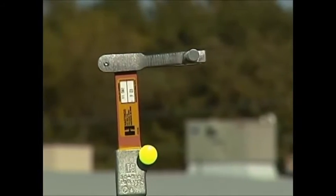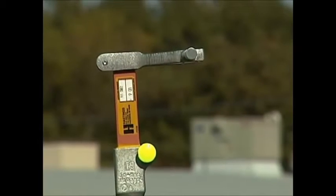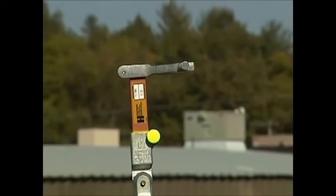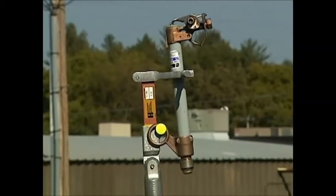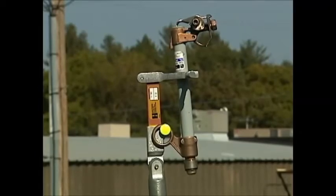You'll notice that on the tool that Kirk is holding, there's a green tab or a green button, and the eye of your fuse barrel fits right into that green button and locks into place. It hangs on your tab, your fuse barrel goes up and snaps into place, and that fuse barrel is now locked in and ready to load or unload.